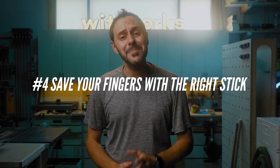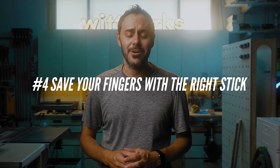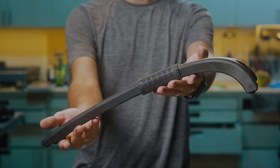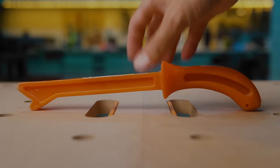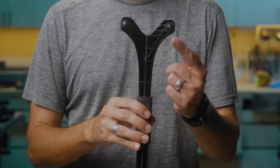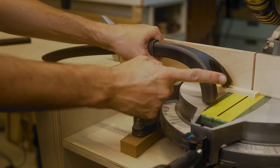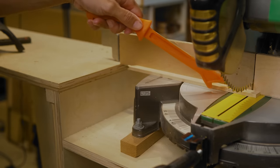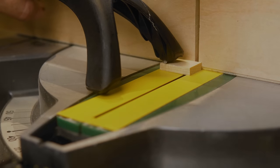But wait, there's more. I've come dangerously close to cutting my finger off at the miter saw. We all end up in situations where we need to cut a small piece, and in a rush we make the foolish rationalization that it's perfectly safe to put our finger inches away from a spinning blade, thinking that if something were to happen we'd be able to react in time — and that's total nonsense. That's where the FastCap $10 million stick comes in. At first it looks like a normal push stick, but it's better because it provides three points of contact. All you do is place downward force on the stick far away from the blade, and your piece is securely held close to the danger zone with your hands safely away. With a regular push stick you're pushing into the blade, but with this you're just pushing down and the three points of contact are doing the work. And it's pretty cheap.